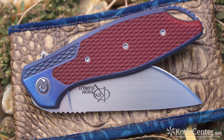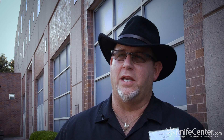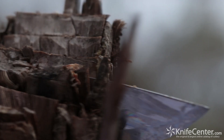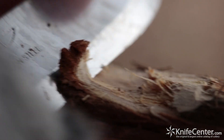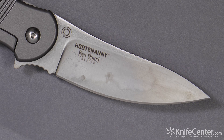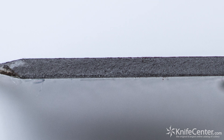How do I choose materials? It depends on the project — what kind of knife am I making, how is it going to be used. Then I test every piece of steel, every new flavor of the month steel, and I test it to its fault. That involves a lot of rattan, heavy whittling, cardboard, corrosion resistance tests, toughness tests. I find out what it excels at, and then I defeat the blade, break the blade, and check out the grain structure of the steel.